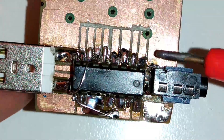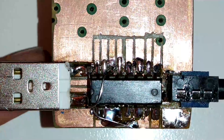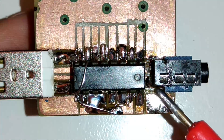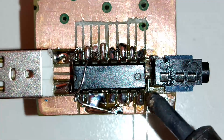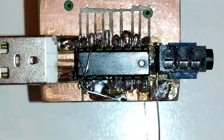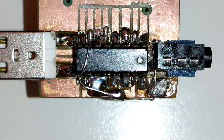On the GNDs, the GND will be on terminals 2, 3, and 4, and on terminal number 7. I made it in the middle here so as not to get on the other terminals. So this is now the GND on the circuit. We have the same thing — now we have to connect the audio of this CI to the connection of our P2, the auxiliary. The GND of the audio is here on this side, so we will put a jumper.